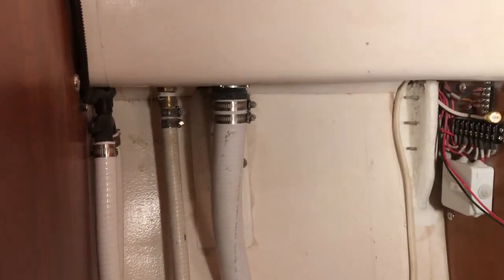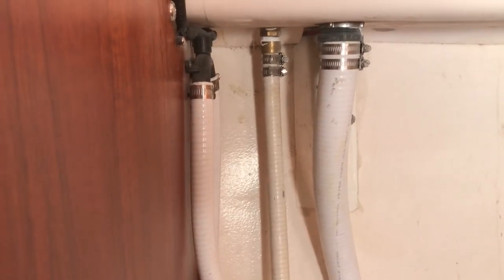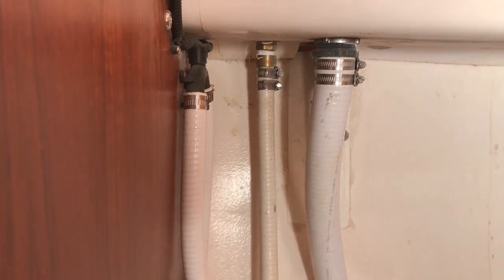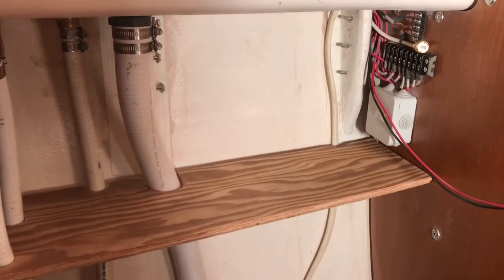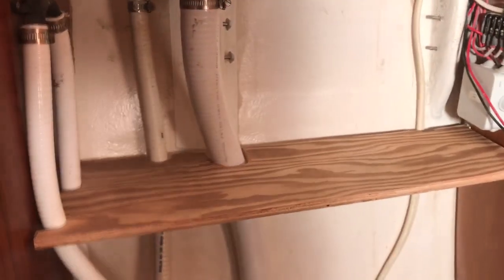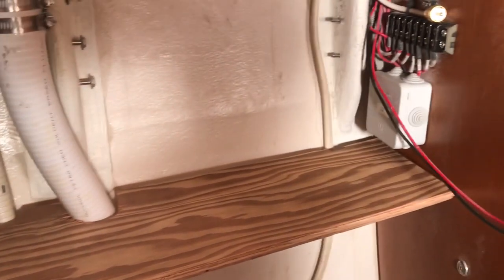This will also hide that wiring terminal block and radar junction box, as well as some of the plumbing here for the holding tank pump-out and the wash-down. My first step is to put in a bottom to this storage using marine plywood — I did have to make sure it fit all those hoses, wires, and such.